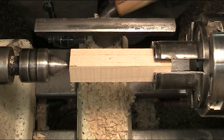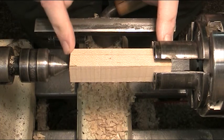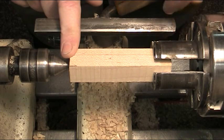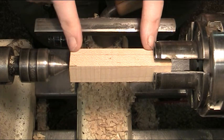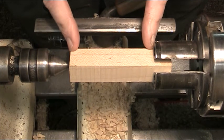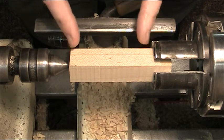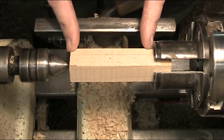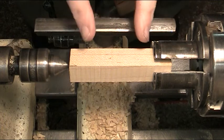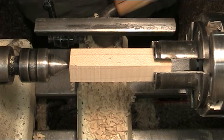So we're going to do a quick set of barbells here. What I've got is a three-inch piece of maple between centers, held in a four-jaw chuck, extended about two and a half to two and three-quarter inches. The end piece will probably measure about an inch and a half to an inch and three-quarters. There's nothing exact about this, but it's good practice. It's a very simple one - only two tools needed: a roughing gouge and a parting tool.